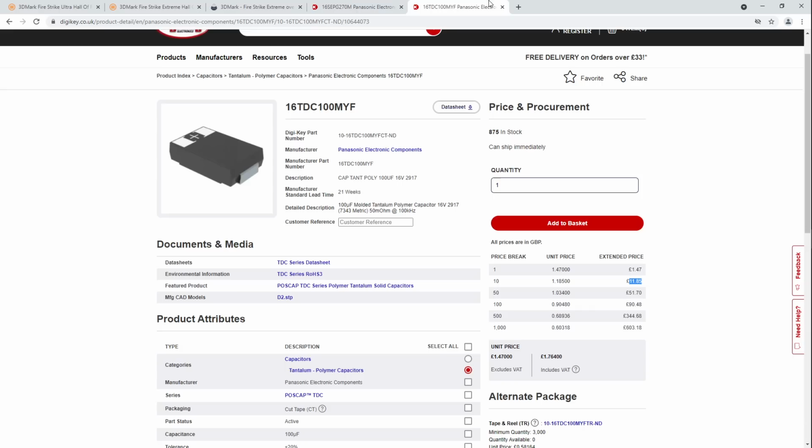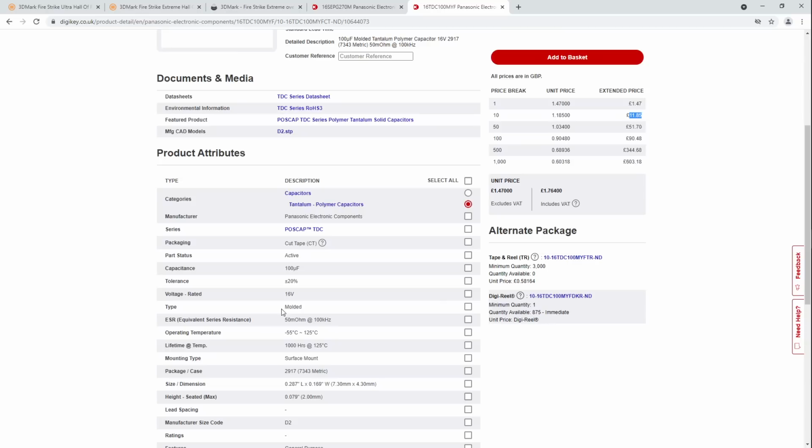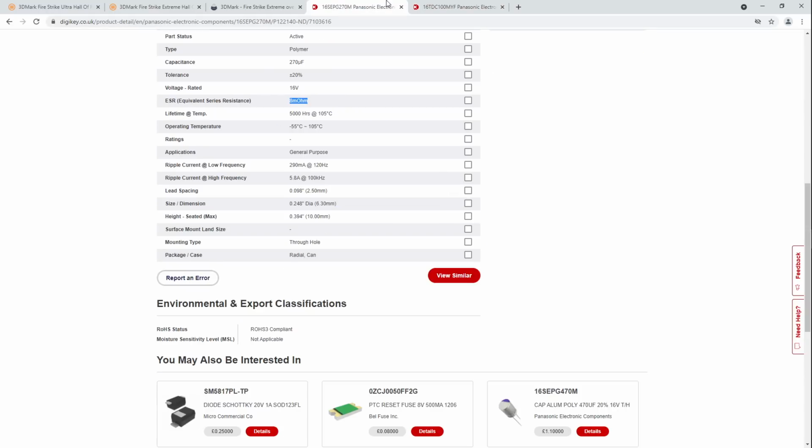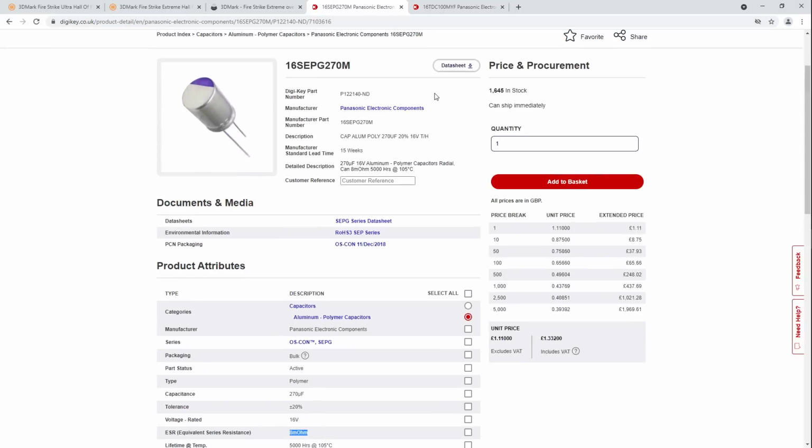Whereas the tantalums are only 2 millimeters in height. So these would totally fit, but they're also really expensive and probably kind of trash, well, not necessarily trash, but I think they probably deliver worse performance. And so, yeah, I'm really annoyed about the layout of the PCB, or more arguably the heatsink design as well. Though, to be fair, the heatsink works really well. I was pushing a ton of power into the card, and the heatsink dealt with it like a champ.